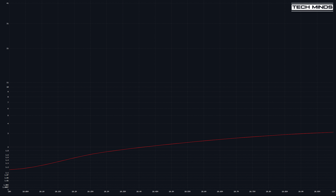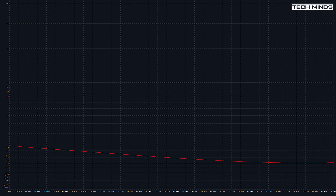The 30-meter band looks like it needs some adjustment to bring the lowest dip up in frequency — this shows the element is slightly too long. I personally don't use 30 meters, but if I did I could either take the antenna down and shorten the 30-meter element, adjust the fold-back, or just use the ATU in my radio. The 20-meter band also looks great, with the SWR creeping up towards the CW portion of the band — again I could take it down and adjust if I wanted to.